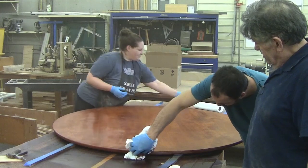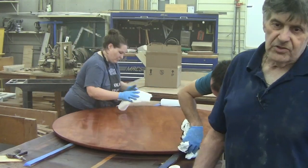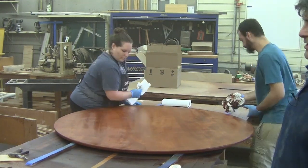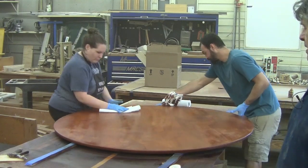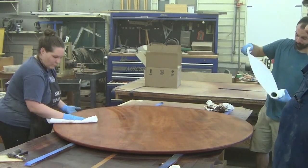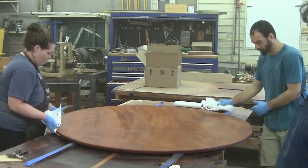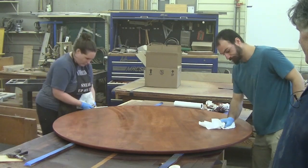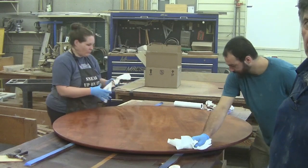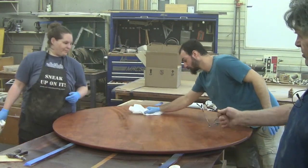That's water-based. Yeah, this is General Finishes dye. This is my New England. This is what is it? 2 light brown and 1 orange. Even though it's a water-based, it still bites into the sanding sealer. Right. Mm-hmm. Well, you can see.